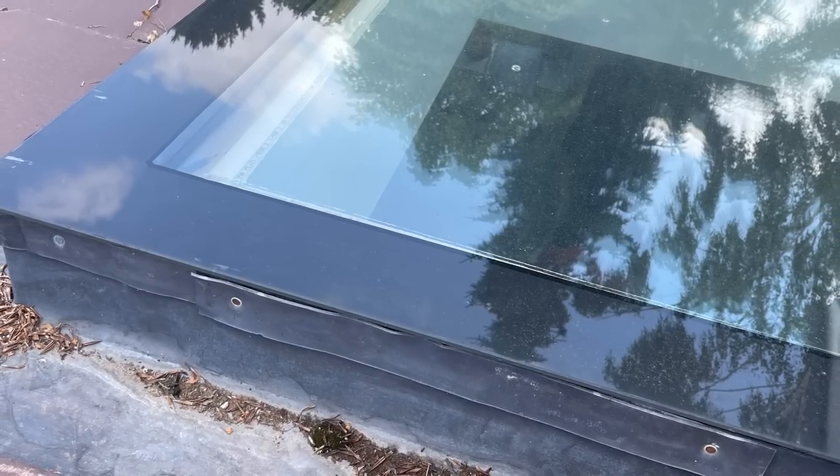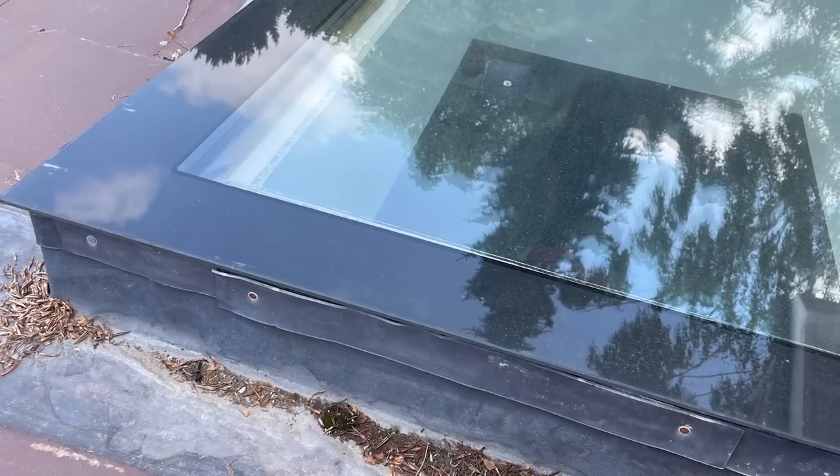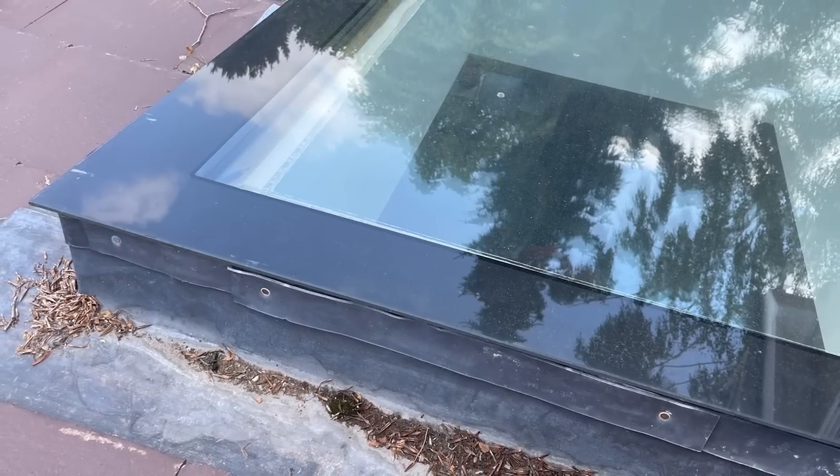Just tell me about the window — it doesn't look like a conventional roof window. It's a frameless thing and it looks like what we'd call a walkover window, the type used on a flat roof that's been tipped up. That's exactly right. When they purchased the lights they discussed the pitch of the roof with the manufacturer, checked the installation guidelines, and were advised the protocol for a pitched roof was exactly the same. The frames weren't supplied, so they had to be built from timber, and the roof lights were lifted into position and popped into the frames.